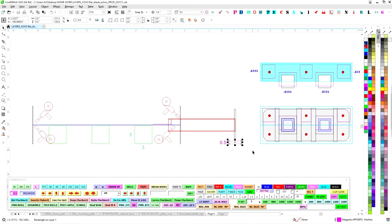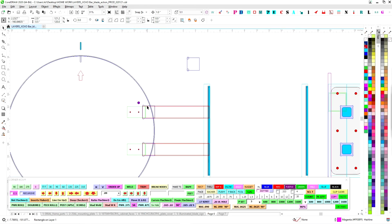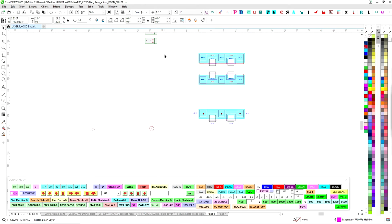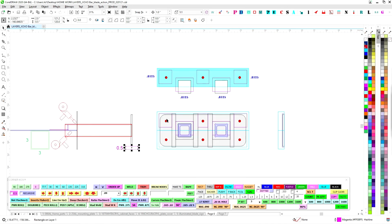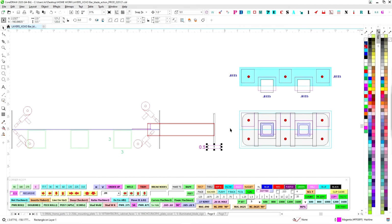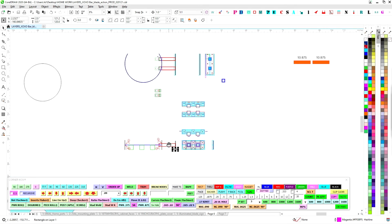So yeah, go ahead and put your 1/2 inch flat bar underneath your plate. Go ahead and slide this in, and then burn this in really good all the way around like you did on the other one. Just burn it here, full beads, weld it to the return, because that's all that's going to be holding that up. So make sure that's burned in very well. And then once that's done, you can kick this up 90 and clamp this to your table and finish burning these really well. Just burn those off, but I suggest not burning this until you have it slid in. That way you have maximum play. And then that's it, pretty much.